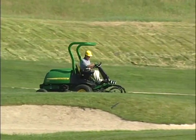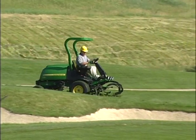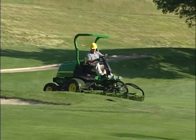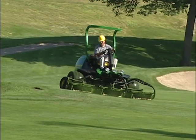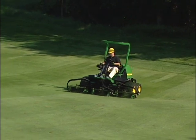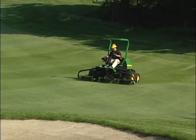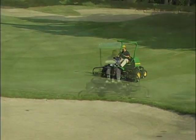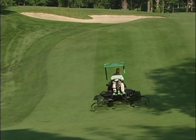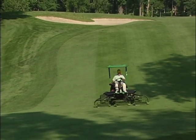Remember, use caution when mowing around bunkers, water features, ledges, or embankments. Before mowing near water, make sure the ground is not too wet, soft, slippery, or unstable. Be careful when mowing slopes — mow straight up and down sloped areas, keep all movements slow and gradual, and avoid starting, stopping, or turning on slopes. Do not mow slopes when the grass is wet.